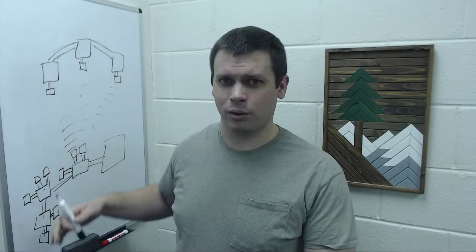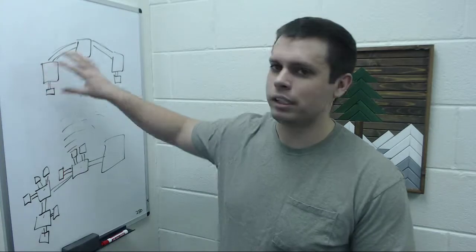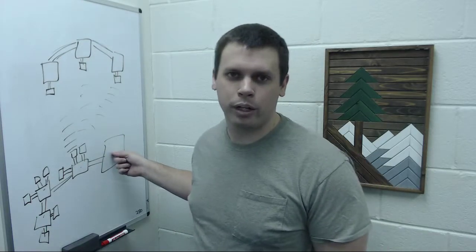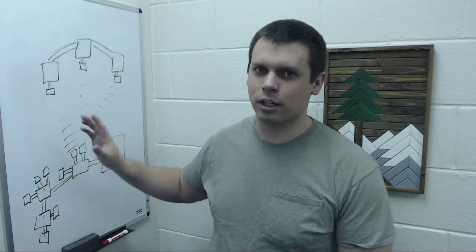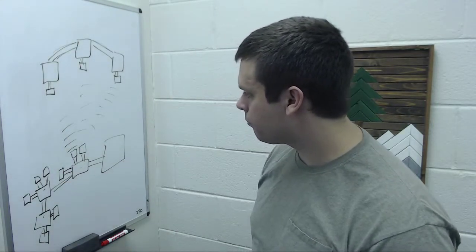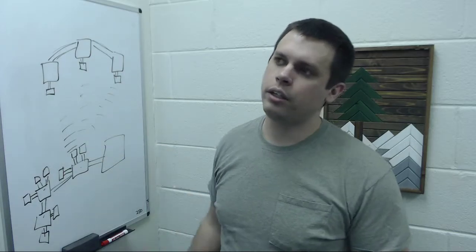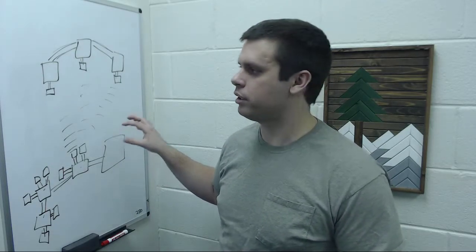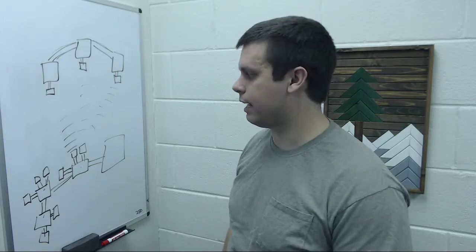And the reason you want a high bandwidth and high frequency of communication between these two devices is because this main computer is making decisions based on what's going on in the actuators. So if you're getting data back only once every 1 second, did the actuator really get to the desired position? There's different ways you could architect that with the assumption that the communication's slow. But I didn't like that because I really wanted to know the exact state, the exact angle of the actuator for visualization. And it just opens up the world of possibilities if you have that. If your main onboard computer running the operating system is able to know exactly what's going on with the actuators, there's a lot more you can do with ROS integrations and things like that.